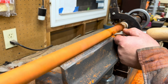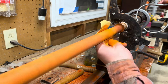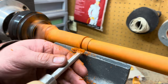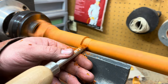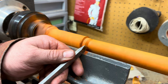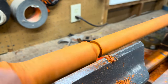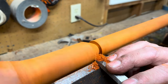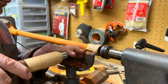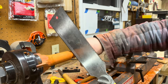I cut it down and leave it proud just by a little bit — I still need a place to put the bearings. Here you can see me going in with my carbide bit, then I bring in the skew. The skew gives you a nice clean edge when cutting a flat bottom on end grain. I still had the other end with a little piece left, so I take little bites to avoid tear-out, then take the whole thing off and glue it together.